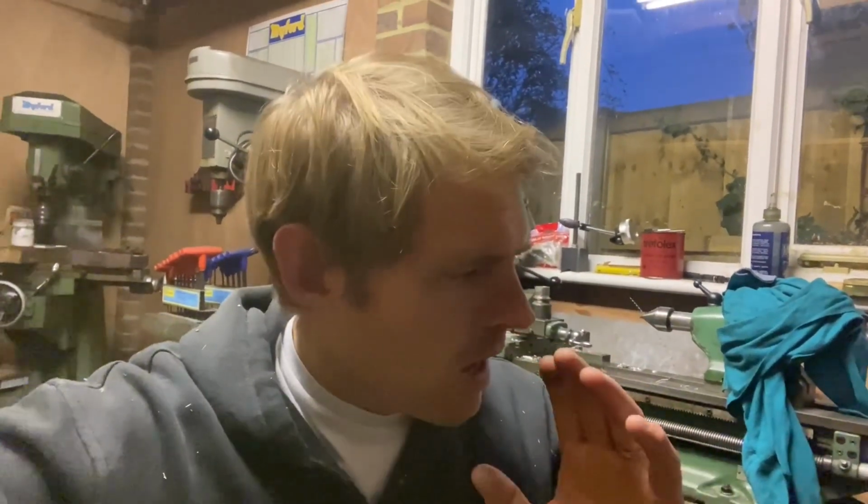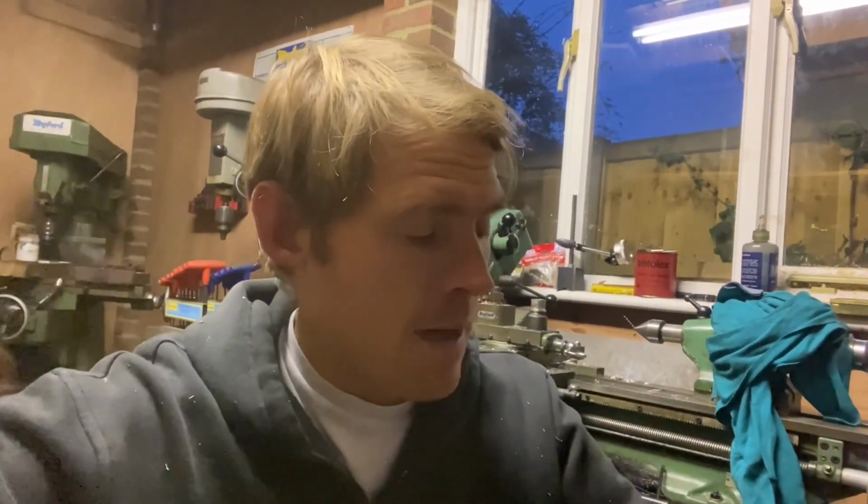So, as I said in the last video, I am happy with the Britannia as far as it's in a state that I can just pick it up and take it to another club or take it to our club and have a run. There are tweaks I'm sure I can get more out of that front end, out of the blast pipe. I think I need to lower the blast, which means the blast pipe being disconnected where it's attached to the inside of the frames, to the exhausts, and goes up through the bottom of the smoke box. Not sure how I'm going to do that yet, but I'm happy with it for now. I'm going to move on to something else for a little while.